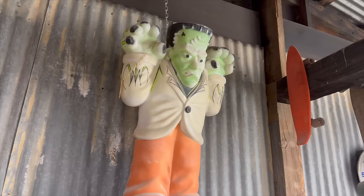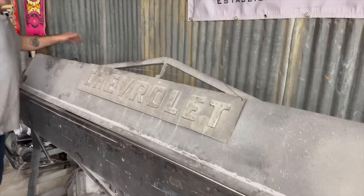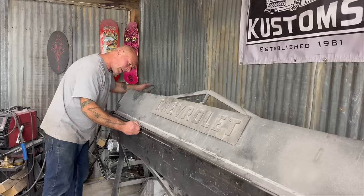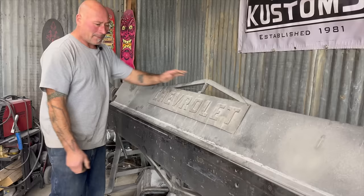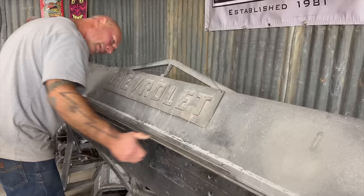Broken handle. We had to get the forklift to pick this thing back up on its wheels. So we got this in there — story time's over. We're going to pull this just a bit, just to get it started, maybe about 30 degrees. We're going to pull it out just a bit more — it's going to be about a one-eighth-of-an-inch radius or so. I'm just showing that line here a little bit. Pull it up again — almost there to 90 degrees. And out to the last mark. Right there. So it's a three-step bend — I'll show you what that gives us in the end.